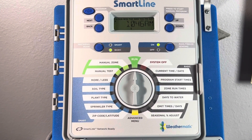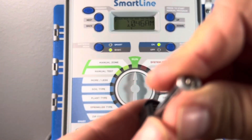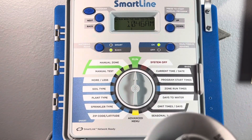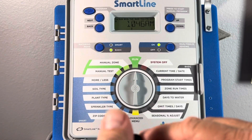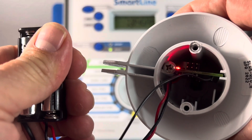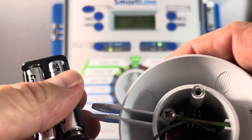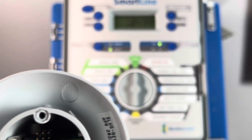The next step is to take our SLW-5 and reinsert the batteries into the battery tray. When we do this, immediately this LED is going to blink showing us its condition. All right, we snapped the batteries in — we had a red blink, so this reset failed and we will have to repeat that procedure again to successfully connect the weather station.